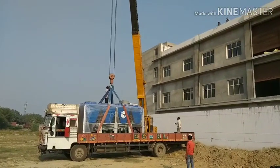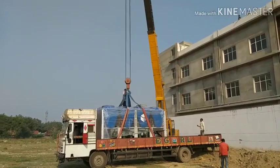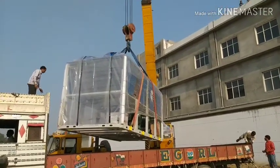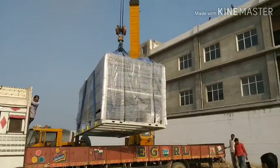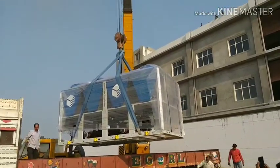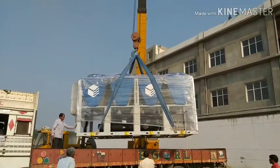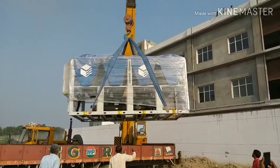You can see the different activities — the person is just hanging the chiller from the hook of the crane. This chiller has been hung onto the long boom crane with the help of a belt, and this belt can be fixed at 4 different points. These are the D-points where you can put the D-clamp of a specific size and lift the chiller from your hydraulic boom.